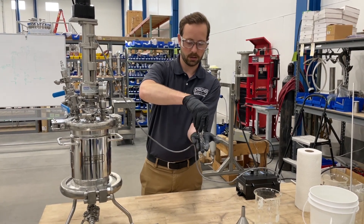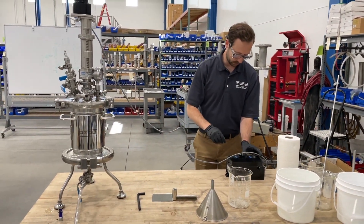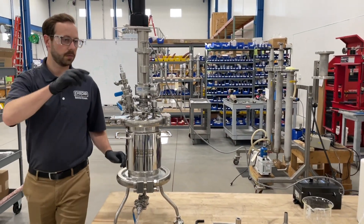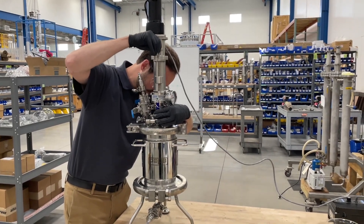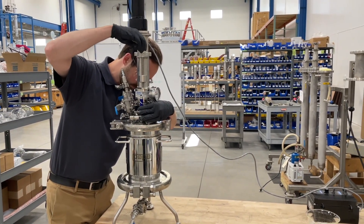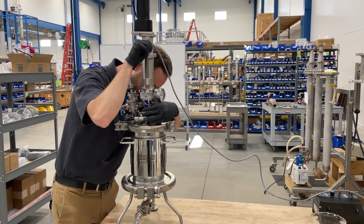In the reverse direction, it digs into the cake. The reason for this is that you will want to dig into the cake to remove any cracks, and then smooth the cake for even drying — to not allow residual solvents to stay throughout the product, but instead get an even drying throughout. The agitator is fit with a manual raise and lower lever that allows the cake agitator to be dug into the cake and then again be removed from it.